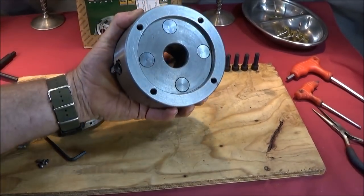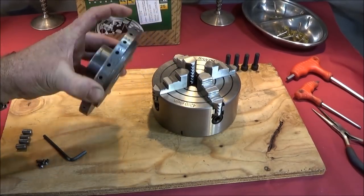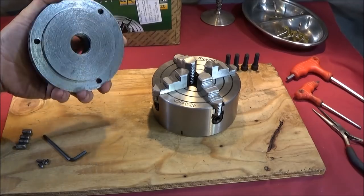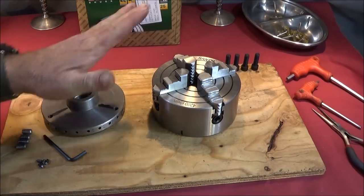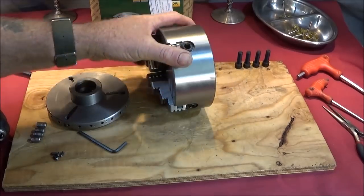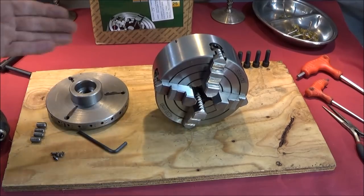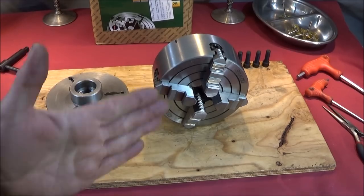I've bought this one for my Myford ML7 and I'm going to be fitting this indexing plate. This is a used one that I had on a 125mm three-jaw chuck. I've now put that 125mm one on my Chinese mini lathe, so this is spare and going on this one. In the past I always used to try and buy chucks that had the bolt holes that go right the way through the chuck because I found those easier to fit to a back plate — you could just use a transfer punch right the way through them.